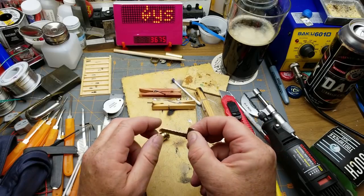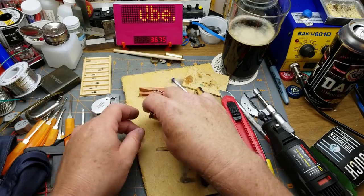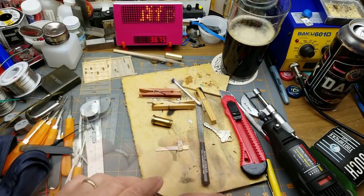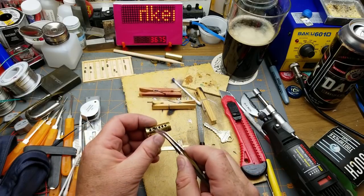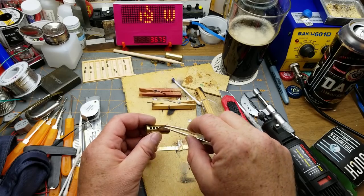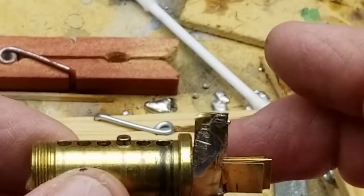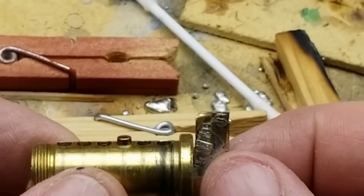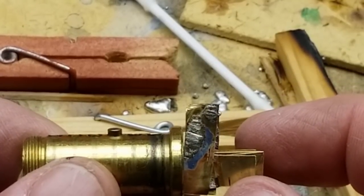There, I've got my spots marked. Excellent. I guess I can just drop the pins in one at a time, can't I? Let's start with a simple one, number 3. 1, 2, 3. So now with that key blank in there, and that pin in pin 3 position where it's supposed to be, I know I have to file that one down by that much.